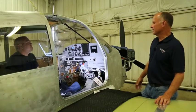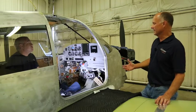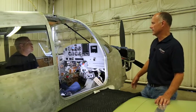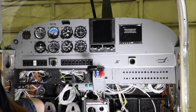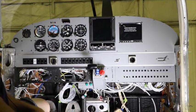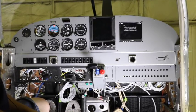The digital engine monitor will take the place of all the analog instruments and display everything digitally. There's also a backup and storage of history showing any spikes or trends in the engine. The database keeps all that information stored, so if you have an exceedance of any type, you can take it out, download it, and get a good idea of what happened.